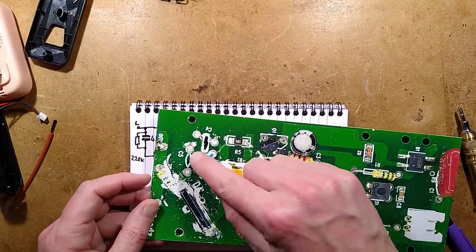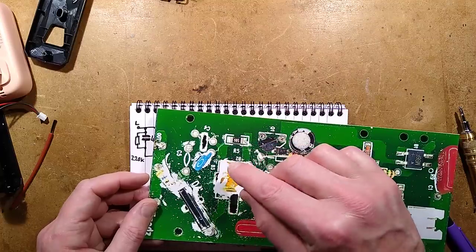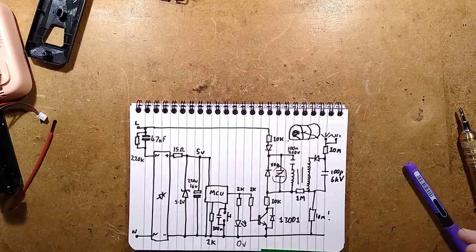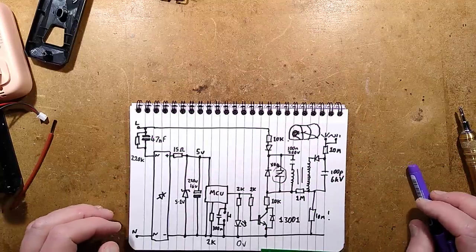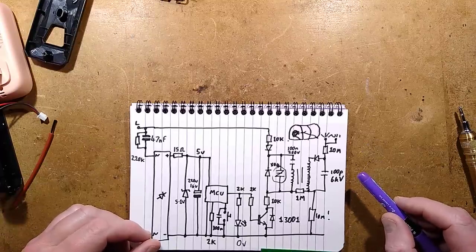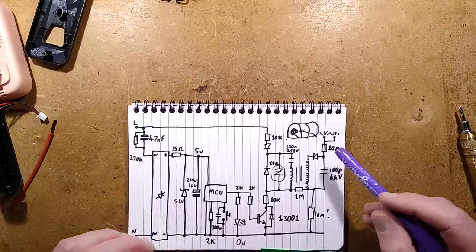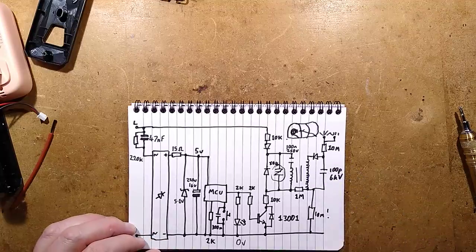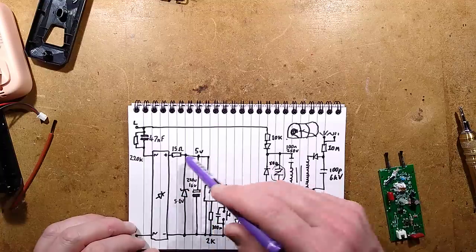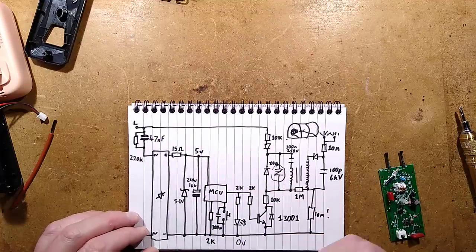It's very hard to measure the voltage across this because you'd need super high impedance circuitry to do so. Just sticking a standard meter across is going to load it down so much, because ionization takes like sub-microamps. It's tiny. It's a very low amount of power. If anything, I would guess that maybe a reasonable amount of the current consumption of this unit is purely just powering the pointless microcontroller. And you could get rid of this.